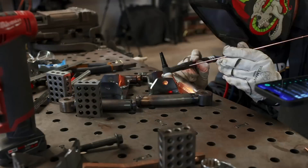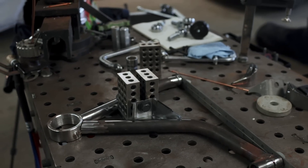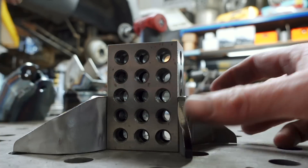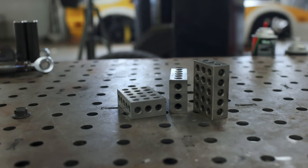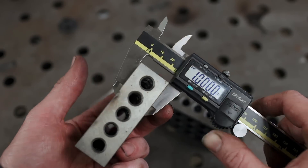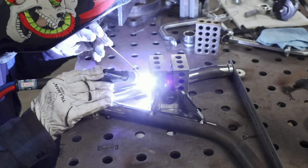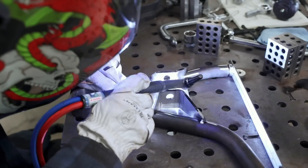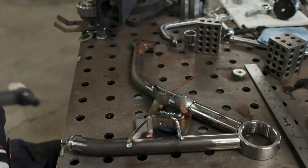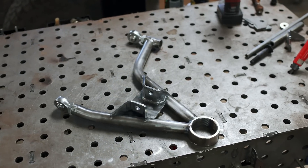I spent some serious time getting both rear upper control arms totally burned in, and then I moved to the front lower control arms for the other lower shock mounts. Now, some of you are undoubtedly asking: what are these blocks everywhere? These are 1-2-3 blocks. I've been told by Adam Savage that these are a machinist's best friend, and I do find myself using them quite a bit. They are precision machined to three dimensions — one side measures one inch, another two, and the final side measures three inches exactly. I design all of my parts in CAD with these dimensions in mind. For example, these shock tabs are meant to be two inches apart exactly, so I just drop a block between them. The result is parts that are straight, as long as you don't warp anything while you weld. My welding came out quite nice, and the control arms are now considered done.